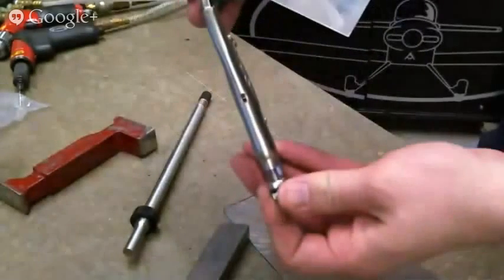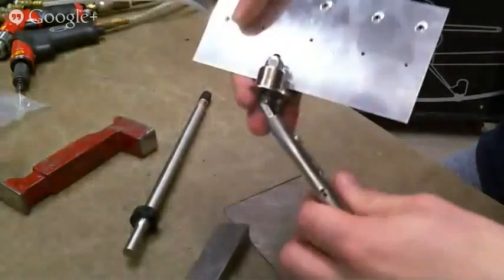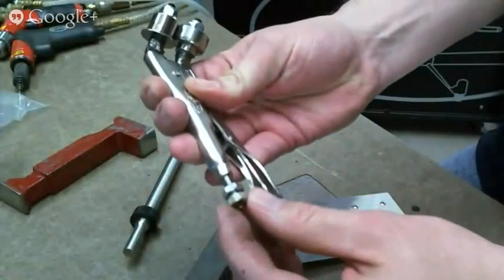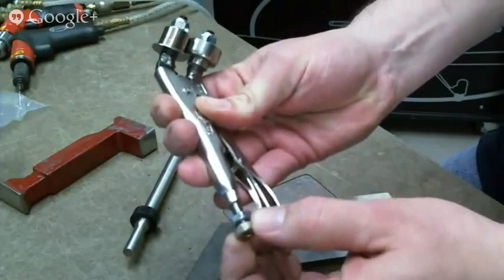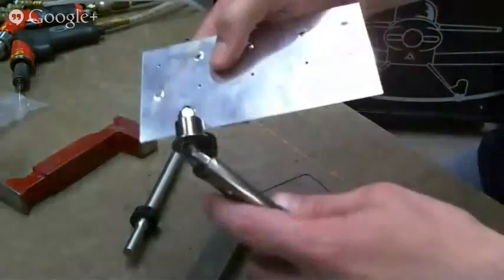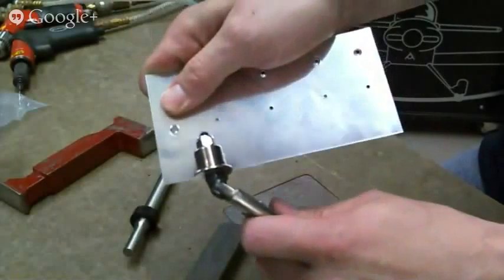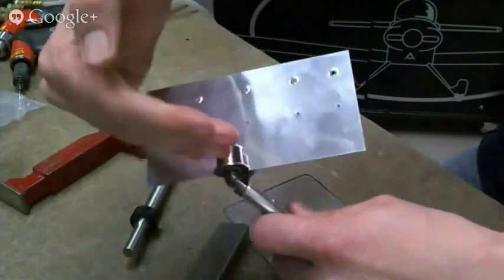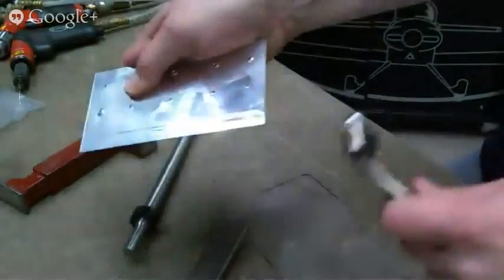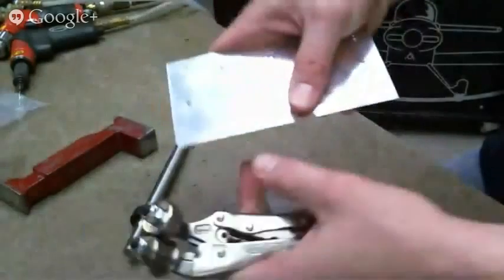And then you want to tighten the screw down until it's just snug. It just stops. You don't want to bear down on it too much. Then take it off of the material and turn it maybe an eighth of a turn, maybe a little bit less than that, and then lock the nut down here. Then put it on the edge, not clear up at the end, but down a ways, and pull it toward you so that this flange is angled in just a bit. And that'll keep it up against the edge. Then come back to where you started, and then just push it off for that last inch or so.